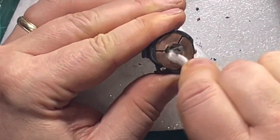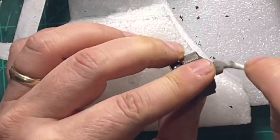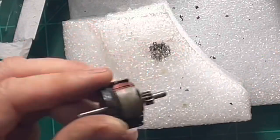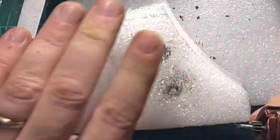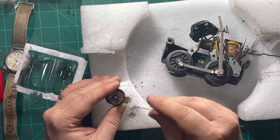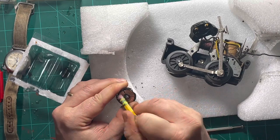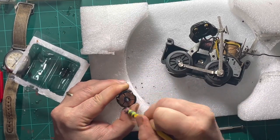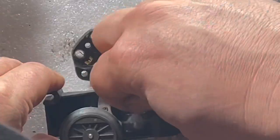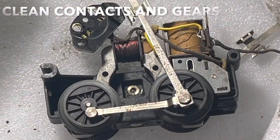The main task is just to try to get any of the moving parts un-gunkified and any of the electric components that would conduct electricity get them also cleaned. It looks like this thing has not been serviced in a long, long time — maybe ever. While I've been doing this the brushes have been soaking in that pool of TV tuner cleaner. I'm also adding just a little bit more TV tuner cleaner to the gear well to get some of the old gunk out.